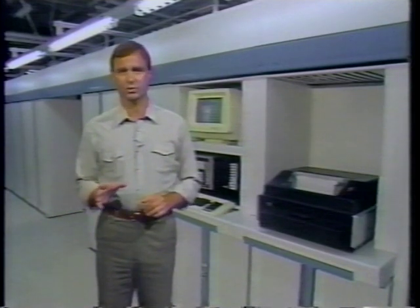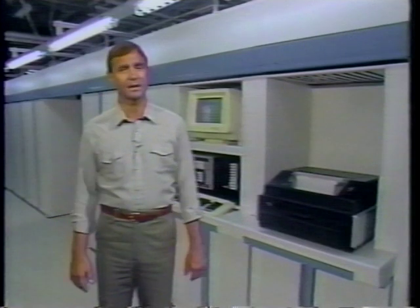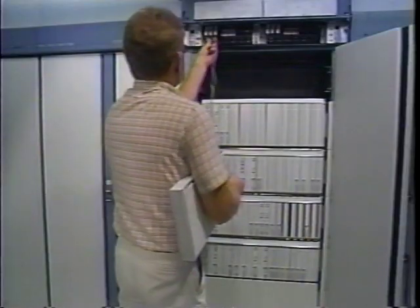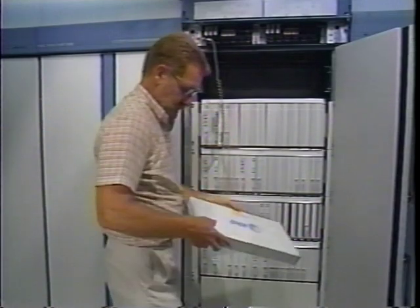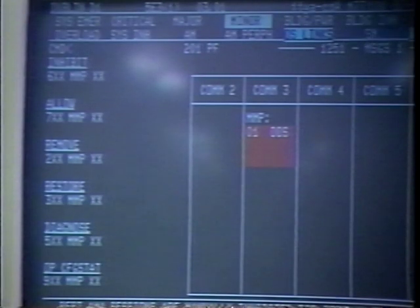A very important point is to always make sure the unit is out of service. If not, you might bring down the system — at the very least, you'll disrupt service. Be sure to use your wrist strap, removing the replacement pack's protective wrapping just before you install it, not any earlier. Once you've changed the pack, go through the restore process and check your work.